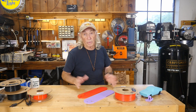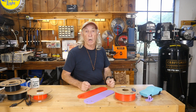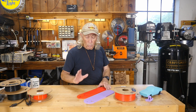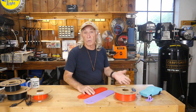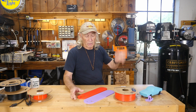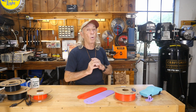What happens out on the road — sometimes I'll pile these up in packaging and leave them in the car. In Texas the car in the sun might get 140 degrees or something. I might have destroyed the models before I even sent them off. What I've been doing is keeping them air conditioned at the house, putting them in the car while it's cool, and sending them from an air conditioned office. But once they go from there to a truck and hauled down the road, you don't know what may happen. I'd really like to get into a PLA or PETG that won't warp with some heat.